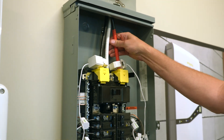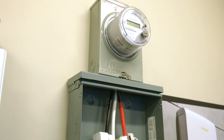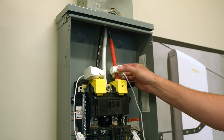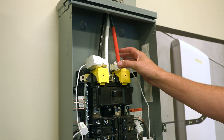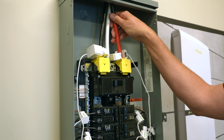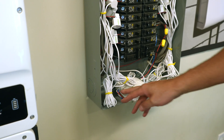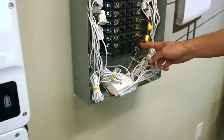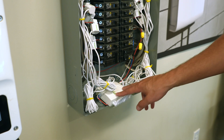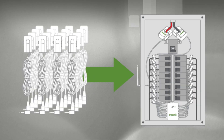Don't try this at a live panel. These are the main power feeds coming from the utility meter into your electrical panel. These current transformers snap on here, and we're collecting sampling data about 3,000 times a second, measuring current with these current transformers. The monitor itself is plugged into either a 10 or 15-amp breaker, and through that we're powering the device and grabbing voltage. So between the voltage and the current, we can calculate actual real power usage.